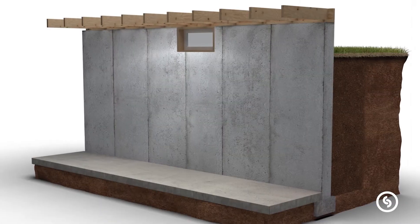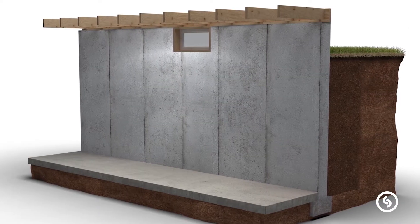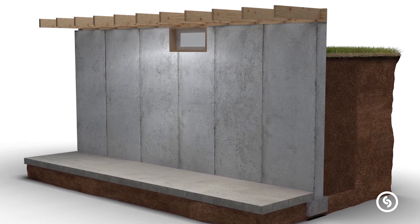There are a lot of ways to build foundation walls, and if you've seen our show before you've heard us talk about concrete block quite a bit. Well today we're going to be talking about cast-in-place or poured concrete walls. The good news about poured concrete walls is they are far superior to block walls in strength, and that's because they include reinforcement right from the beginning.